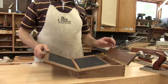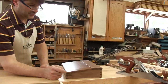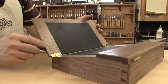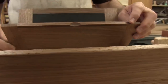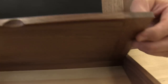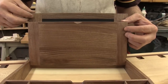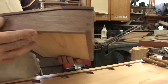Let me show you some of the features and some of the skills that we would need in order to build this. This one is out of walnut, and you could certainly have your choice of woods. All of these breadboard pieces have a tongue and groove joint — you've got cross-grain construction there, but it's small enough that I don't think it's going to be a problem. You're cutting a groove in this piece, and then cutting a tongue on the other piece, and that's on both the outside lid and the inside one. It wouldn't be a Rob Cosman project if it didn't have dovetails — we've got two dovetails on all four corners.